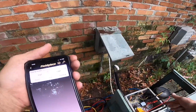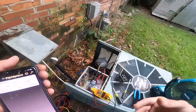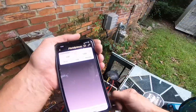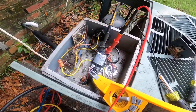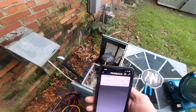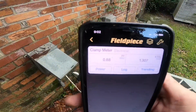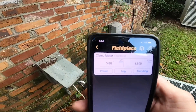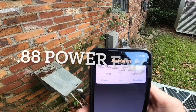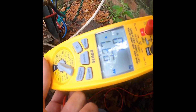After getting the right capacitor — and yes, I'm checking the voltage on the wrong side, but I can't really get to it — I've got a new capacitor, new contactor. I've gone from 0.75 power factor to 0.88. The closer to 1 we get, the better. The amp draw on that compressor was like 10.10.